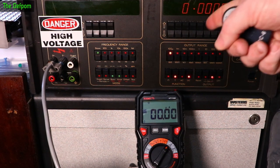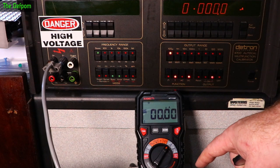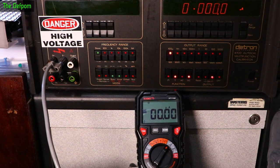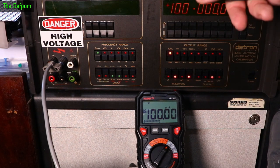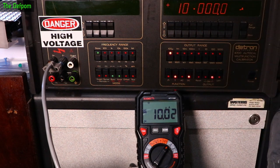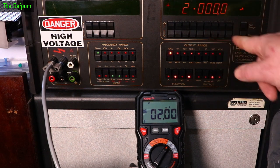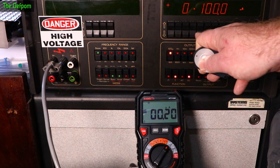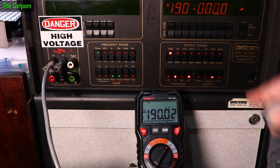Now testing DC current — microamps, milliamps, and amps. Being careful not to go above 200mA on the fused jack. On the microamp range: 100µA looking really good. At 10µA it can see it. At 2µA no problem at all. The sensitivity is actually quite good. On the milliamp range: 100µA shows, one count out. 1mA looking really good. 10mA is a couple of counts out. 100mA looking pretty good. The current range has actually been pretty accurate.